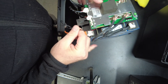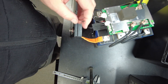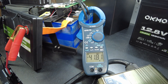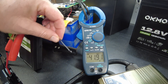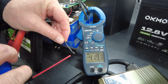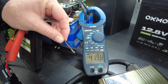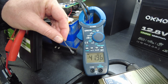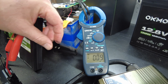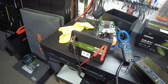Here's a little thermal sensor. Let's check to see if the low temperature protection works. We are putting in 41.8 amps. Let's try to freeze this little temperature sensor and see if it stops charging — and yep, it sure did. So we've got working low temperature protection.